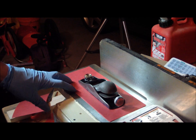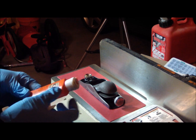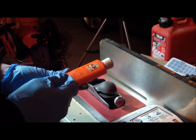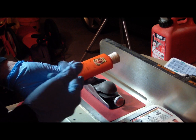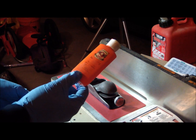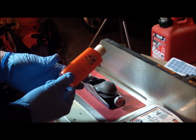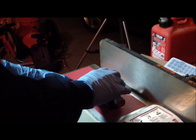I've taken a piece of wet-dry 220 grit sandpaper and stuck it down to the bed with a little bit of oil. This is just a general purpose non-drying, non-protective lubricating oil — I believe I also got this at Cabela's. I use it for a lot of things: tapping holes, lubricating, various other things. It's just good all-around stuff to have. So that's sticking the sandpaper down.